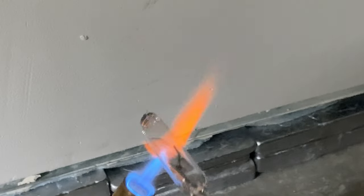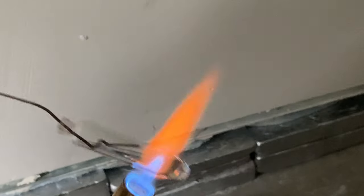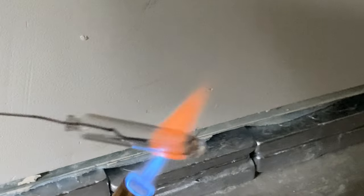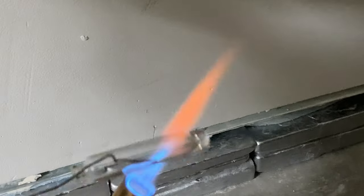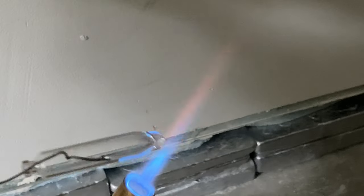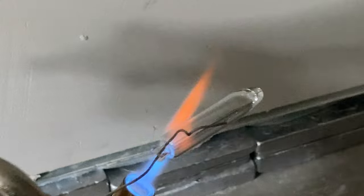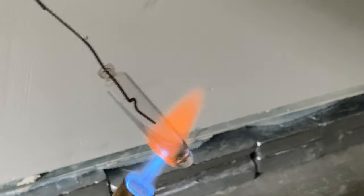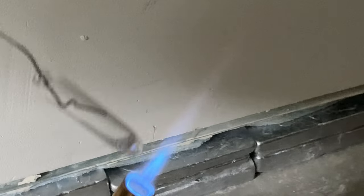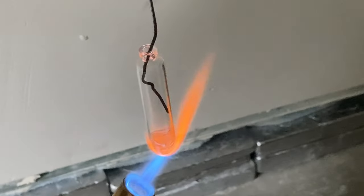You just give the whole thing kind of a heat bath like this. A propane cylinder like this can be refilled — I'll show that in another video, it's kind of a dangerous process. You can buy them for camping; they're not terribly expensive. This wider one is typically used as a camping stove, while thinner ones are used with blowtorches like this. This kind of blowtorch is typically used for brazing pipes, like soldering copper pipes together in a home hot water system or in industrial and commercial applications.